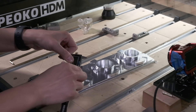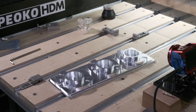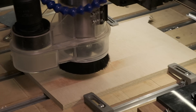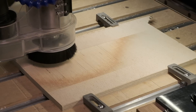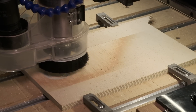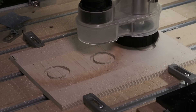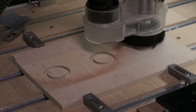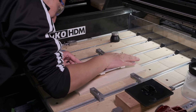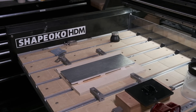Despite the aggravation of that mishap, I immediately started thinking about how to salvage the situation — I felt there was a pretty good chance I could save the parts. During the adaptive roughing toolpath, I had left half a millimeter of stock to leave on my parts. If I could re-zero my stock to within a half millimeter margin of error, I could make it look like nothing had ever happened. I figured I could hold onto the central bores of the encabulators in some pockets milled into MDF and add in some locating features on the bottom of the bar stock. I designed a custom fixture that would snugly capture those cylindrical bosses, taking into account that the actual diameter I was targeting wasn't the final diameter — I had to add in the stock to leave. The success of this turbo encabulator saving operation now rested on nothing but friction.